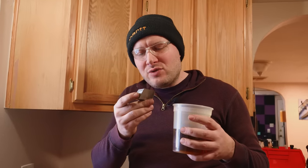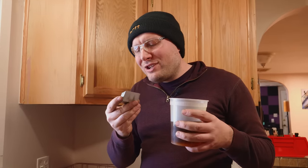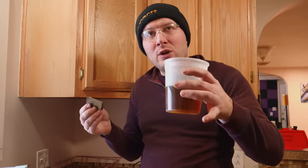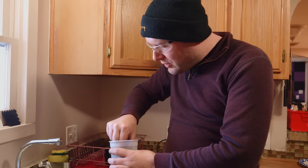As I was grinding this surface clean, I noticed if the light hits it just right in the middle, I almost feel like I see something. It might be some leftover weld that I didn't grind out, a little of that TIG rod or the MIG welder. I'm not really sure though, it's so fine, it's probably not a problem, but just to be safe, I would do a little ferric chloride dip real quick, and hopefully that would reveal any issues.